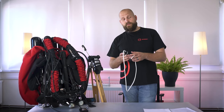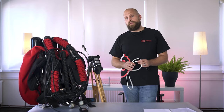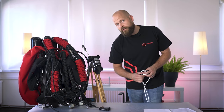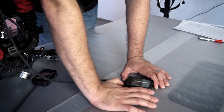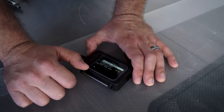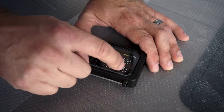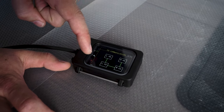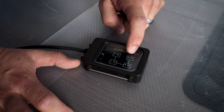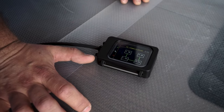The calibration was very easy. Carry on and follow the steps in your assembly checklist until the unit is fully assembled. Now we're going to look at the pre-dive sequence in our handset. We go into the main menu where at the very top there is pre-dive. We enter the pre-dive check. The unit checks communication: left handset communicates with the left control unit, the same with the right control unit and right handset. If running with only one handset, the unused one will be darkened. That was step one.